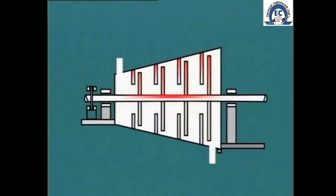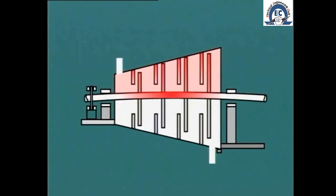However, there is another more vital reason for keeping the unit turning over when it is taken off load. Remember, the turbine rotors are extremely hot. If we were to stop them immediately after shutting the machine down, experience shows that the heat rise causes uneven expansion and distortion. This is known as hogging.